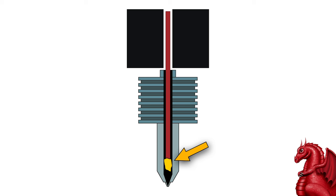The other common cause of a filament jam on the A1 and A1 Mini is during filament changes or when using the AMS swapping filaments. You run the risk of breaking off a small piece of filament in the extrusion system, which then acts as a block. To fix this, we slightly disassemble the extruder — remove the filament hub — and that piece will usually fall out cleanly. If it doesn't, feed a fresh piece of filament from the top to push it out.